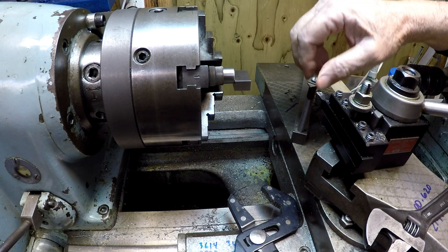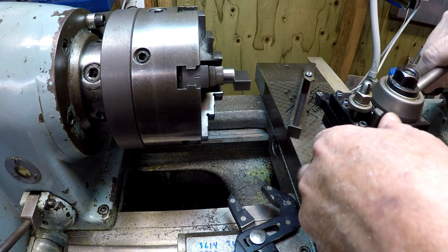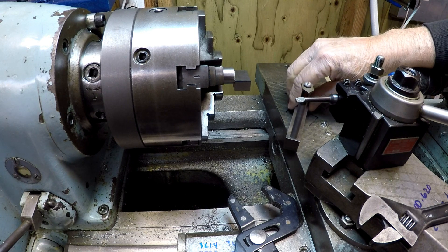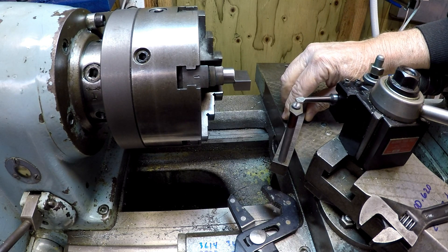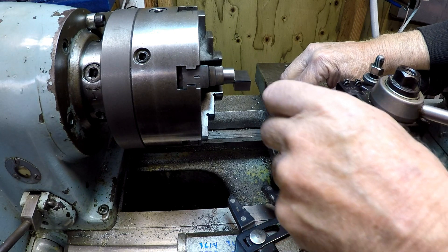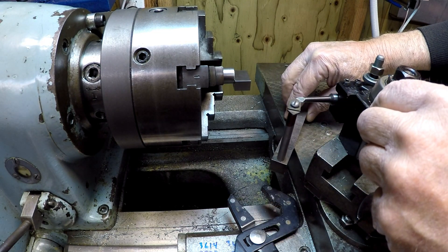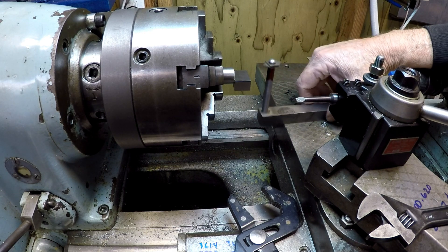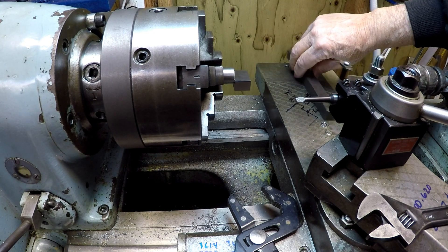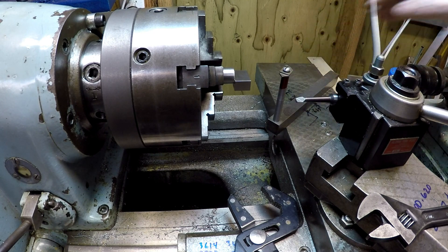You can do it either way, or you can spin it around and check it so that you're over the top of it. What's really nice about the long bar is, say you've got a boring bar in there — the boring bar is on the wrong side? No, it's not. You can reach right over and check it. You can see this boring bar is a little low right now — you got to adjust this one. But you just spin it around and you can see it goes right over the top. So that bar is low. Pretty simple build. It's real accessible. I can reach over to the tail stock, reach over the cross slide, anywhere I need to reach and get a height. It's a good little design, little tool, and maybe it'll help somebody.